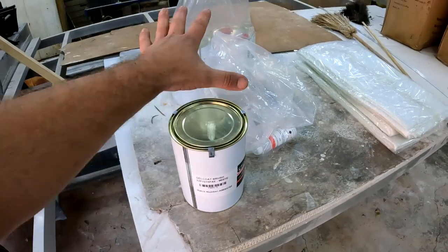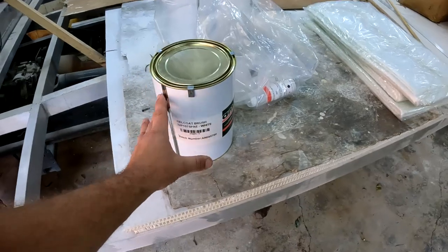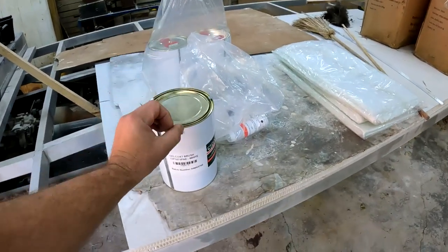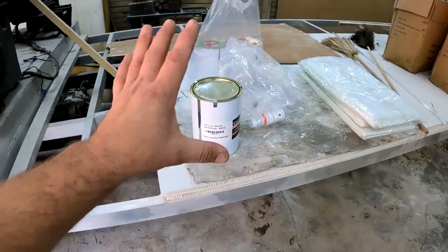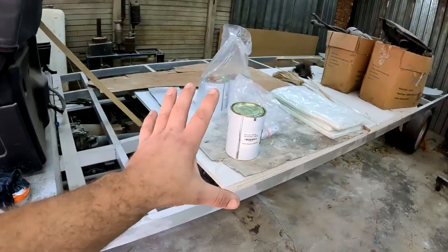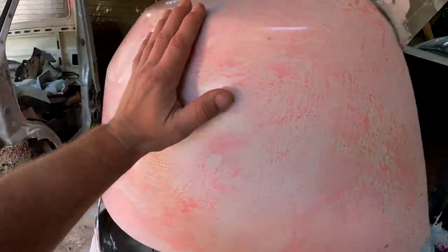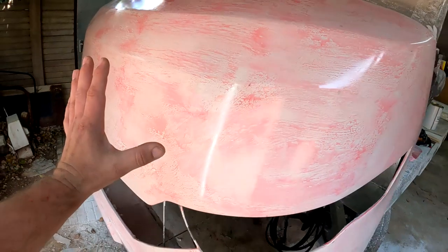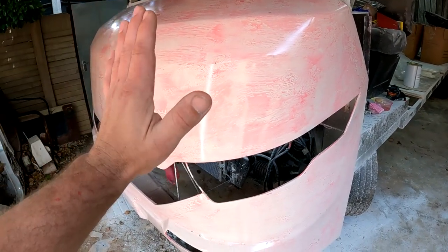That is basically just epoxy that has been colored or dyed or stained, and I chose white, and I also think that it's a little bit thicker than normal epoxy resin, and I'm going to be mixing that and then just coating this whole part with a layer of gel coat, and then after that I can start layering some fiberglass on top of that.